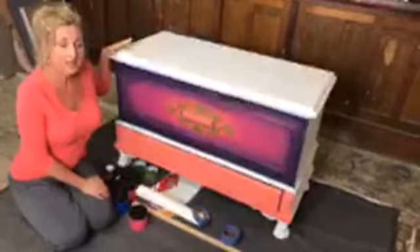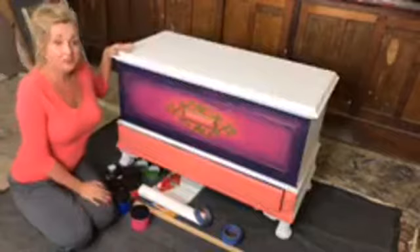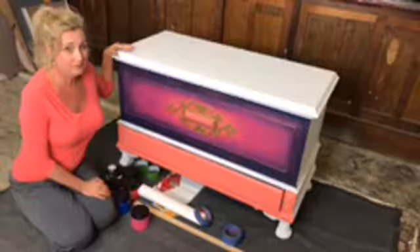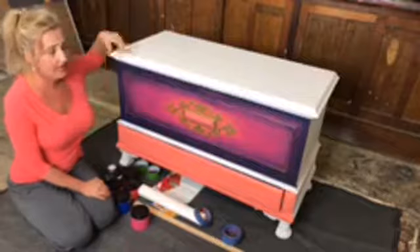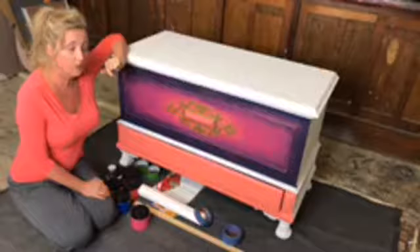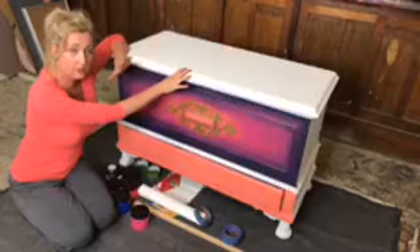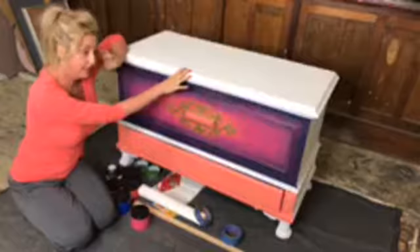What I've done to the piece so far: I cleaned it really really well using the White Lightning by Dixie Belle — it's a really good cleaner and it brought off some nasty gunk. Then I wanted to prime it, so I used Boss Primer in white on the whole piece. I needed to color block because I knew I was going to be doing a black and white harlequin on the top, and I didn't want any of that pink showing through, so I color blocked with one good coat of Boss Primer in white.